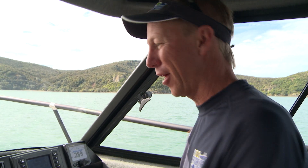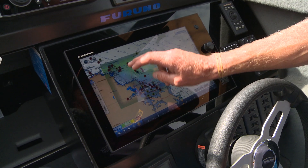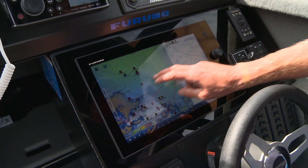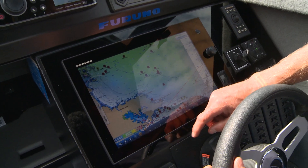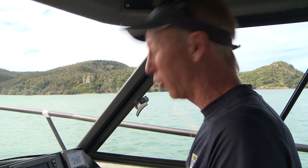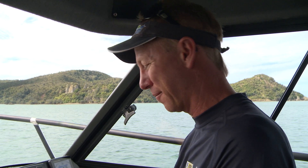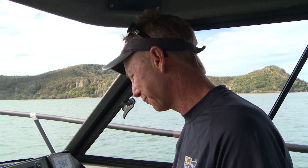Weather and tide — now this is cool. I can just pair that up with my phone and download the latest weather forecast. I've selected an area and chosen a forecast — I've downloaded the sea surface temperature charts. I can also overlay wind direction, wind speed, swell direction, and wave height. I can animate it all to see it happening for the next four or five days. I can even download the plankton and overlay it straight onto my plotter — a full forecasting system right at my fingertips.